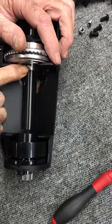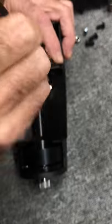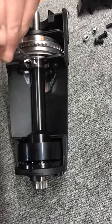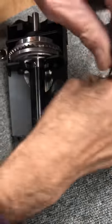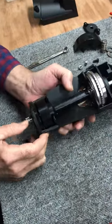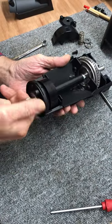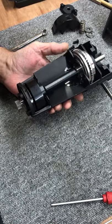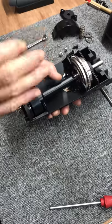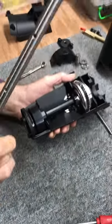The only thing that's holding the axle in there is this screw here. Once again, adjustment set on fine. Straight down. Out comes the last one. The axle is now free to be removed. You grab a hold of the end of it by the gear and you pull the axle out in one smooth motion. You don't need to stop — if you stop, you can get it jammed in there because it's really tight tolerances. So I just take this and yank it out. There's my axle.